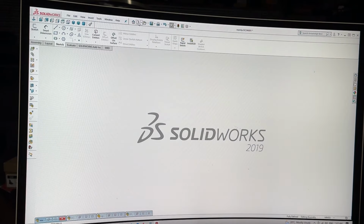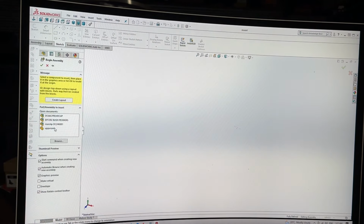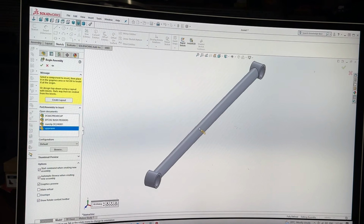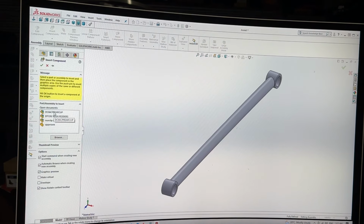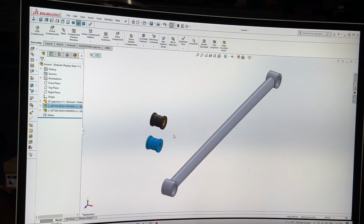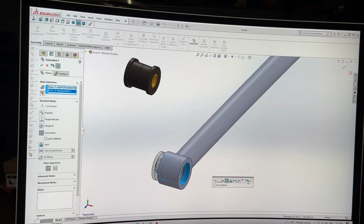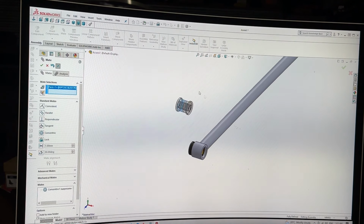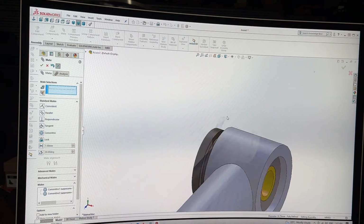So now we've got both those files open. I can start an assembly. Do a little bit of upper arm, and then insert a bush like so. Do a times two, hit a mate for inside circle into outside circle, OD to ID action,